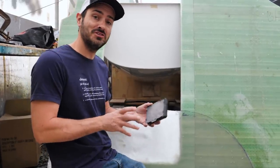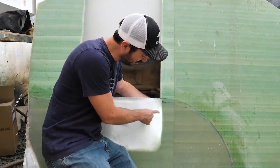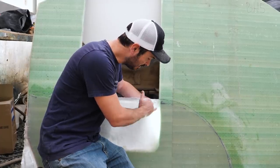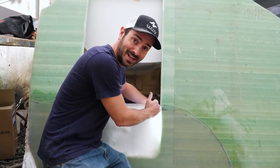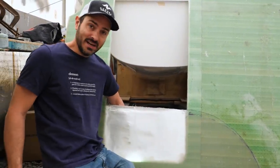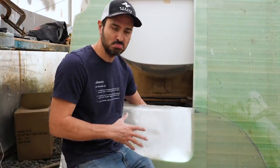What we figured out is: if we use one of our lights from the camera and put that on there, you can actually see right where the original line was and where our extra laminations are. So now you can go through and either trace it with a pencil, or just have Jess hold the light while I cut it all out — that's going to be our plan. It's still not going to be an absolutely perfect edge like it was with the router, but it's going to be good enough, and especially since these are going to be covered in wood trim later, we can hide that.